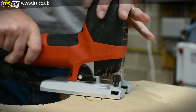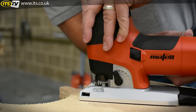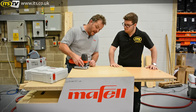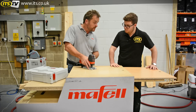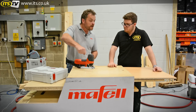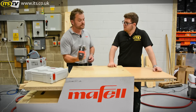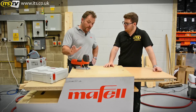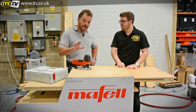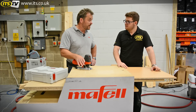The P1CC has a barrel grip rather than a D-handle, which gives you more control. When using the jigsaw, your hand is directly above the blade, whereas with a D-handle your hand is further back and you have less control. A lot of people also like to use a jigsaw from underneath, which is far more popular in Europe — in fact, the UK is apparently the only country that uses the D-handle. Once you start using the barrel grip, you realise why it's better.